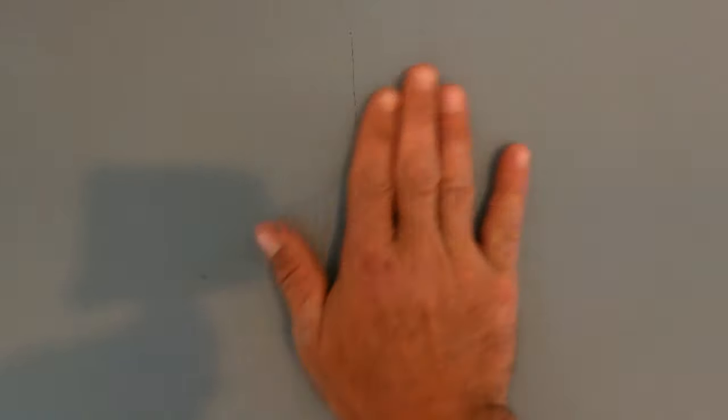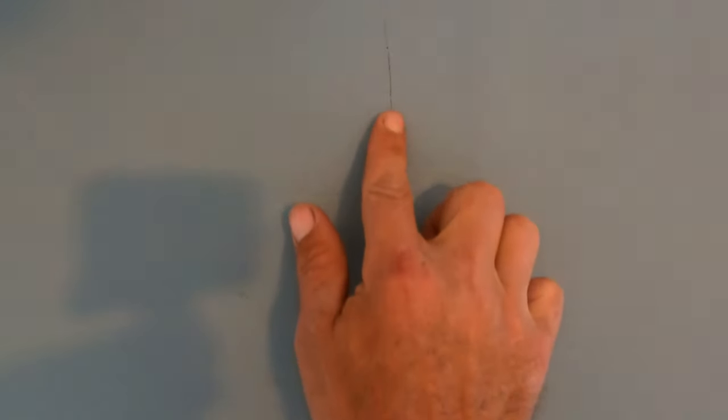Yeah, so I've plastered in there and made good the chase out there, and repainted, but I'm not really happy with the results there, as the plaster's sunken in. I'll just rub my hand across there and I feel like the plaster's sunken in about a mil. There's a tiny little crack going down there as well. Considering the chase was about an inch deep, that was pretty much expected, but I thought that might have been okay. But on closer inspection, after I've painted it and let it dry out, it's sunken in. So I need to fill this in again with some fine fill, get that nice and flat.